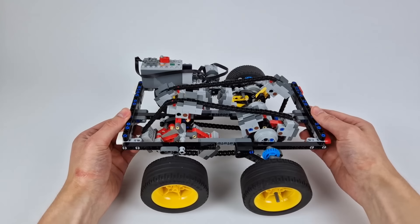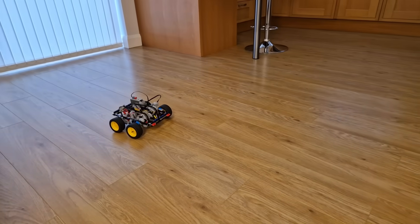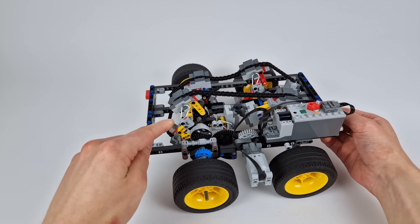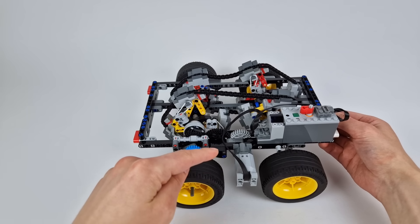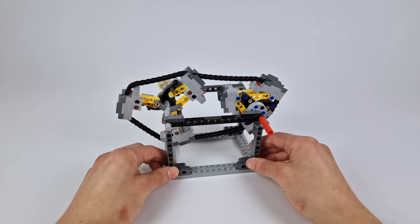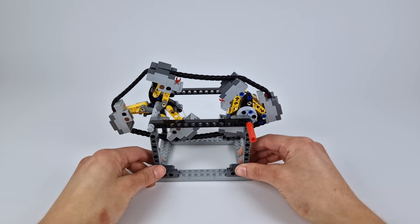This is unfortunately the downside of trying to gear the automatic CVT for more speed, as it means the minimum resistive torque that causes it to start changing gear decreases. Here, we haven't increased the speed that much, so it's not too noticeable of an issue, but if we geared it up much further, then that top-end speed would essentially just be wasted on this car, as it will never encounter low enough resistance to actually be willing to change to those higher speeds. The solution to this could be to use stronger rubber bands to hold the wheels open, so they're not so fast to change up to a higher gear ratio, but if they're not changing gear as easily, the motor will have to provide more torque when the output torque increases, so it will be put under more stress. Just something to think about. But anyway, that's just about all the testing I wanted to do with this automatic continuously variable transmission. I know the past few videos have all been focused on this, but it's just because there's been so much I've wanted to do with it. But now I think it's time to change gears — so in the next video I'll be working on something pretty different. Thanks for watching and I'll see you then.